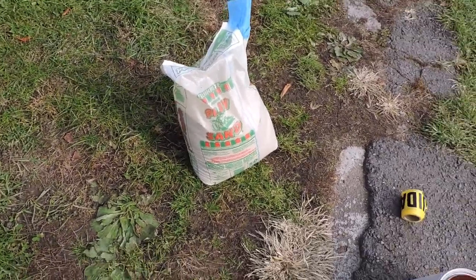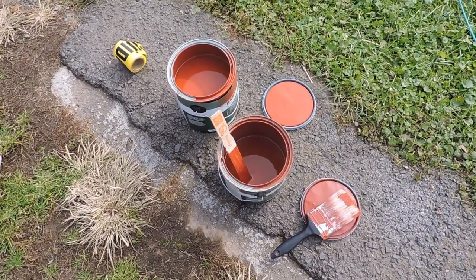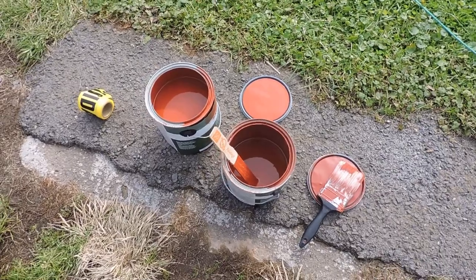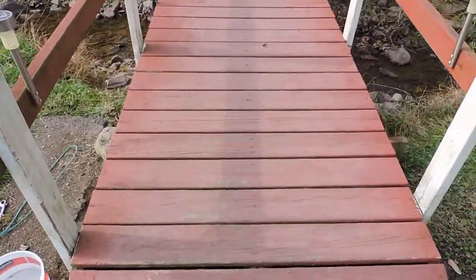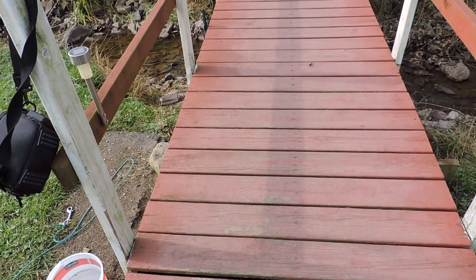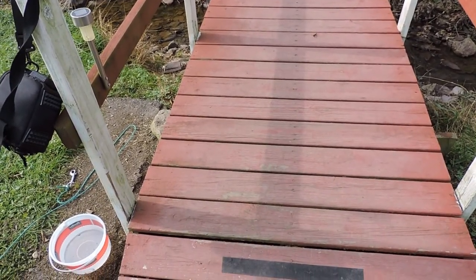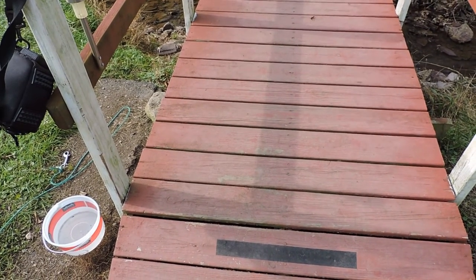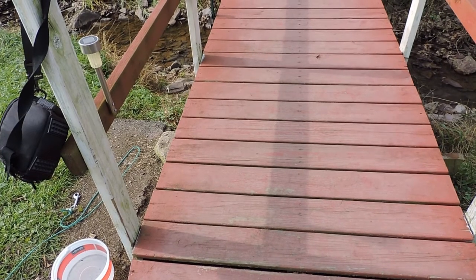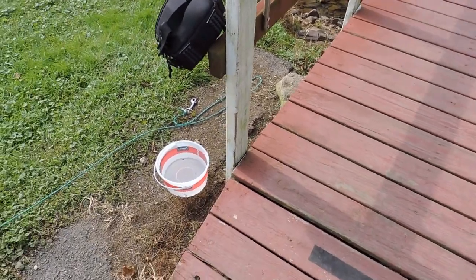All I'm gonna do is dump a fair amount of sand in, mix it up until it feels like a gritty mixture — not too much sand, because I want the paint to adhere well, just enough for a rough surface and extra traction for winter. I typically wait until later in the fall to do this, even though the weather is iffy, because if I did it in the summertime a lot of the sand would wear right off over several months. In summer when the deck is wet it's not that slippery, but once you're talking ice, snow, or frost, it's another story. That's why I'm waiting until November.